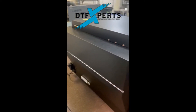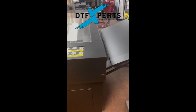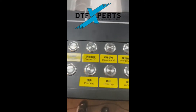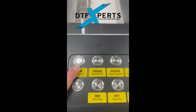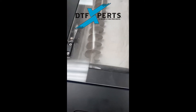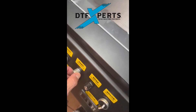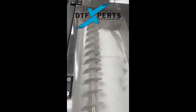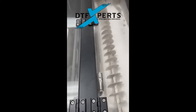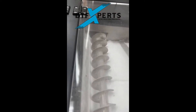Gen 3 dryer functions. On the top row we have the top spiral, which is actually the top and the bottom spiral down there. If we turn this on, we can control the vertical spiral which brings the powder into it. So we cut the top spiral on — both the bottom and the top are working — and we turn the vertical spiral on and it will start to bring the powder up.